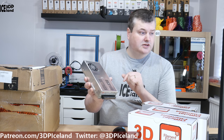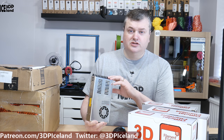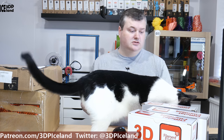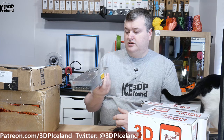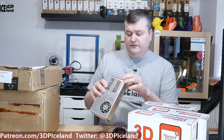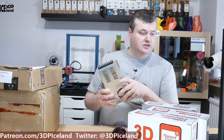And then I have a power supply. This is a Meanwell power supply, 12 volt, for the CR-10. The CR-10, if you saw the initial thoughts video, had a broken power supply right from the start. I've been absolutely unsuccessful with both Creality and Light in the Box, the reseller, to get a replacement. It's been almost a month and still no shipment. I've raised a dispute with PayPal to try to get my money back. In the meantime I've been using an ATX power supply, but I want to have an internal power supply. So I got this Meanwell NES 350-12 — a 12 volt, 350 watt supply, very similar in power to the original. It's a proper manufacturer that people are using, so I'm gonna swap this in at some point.